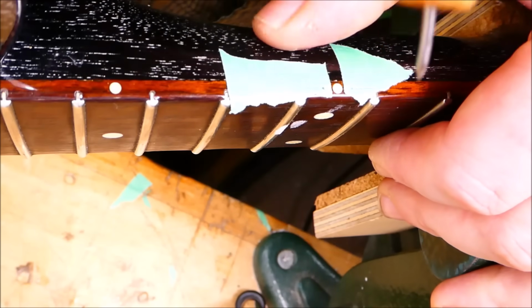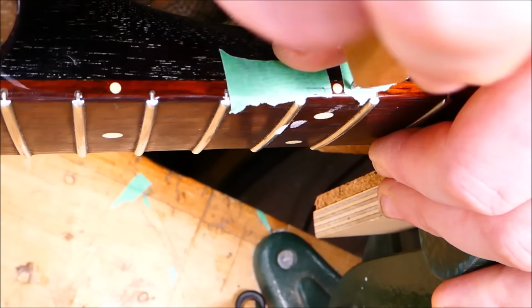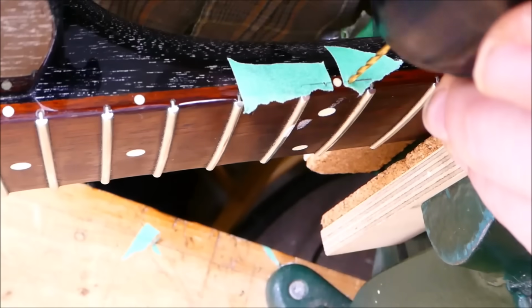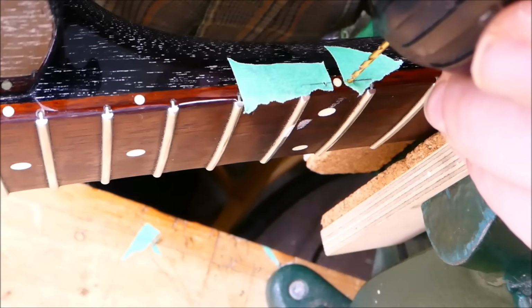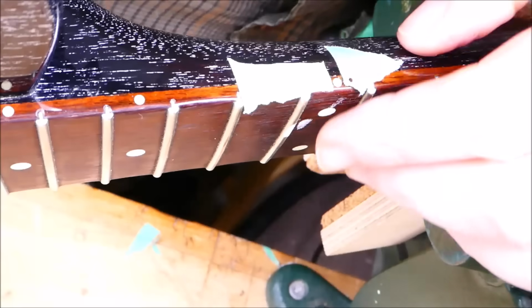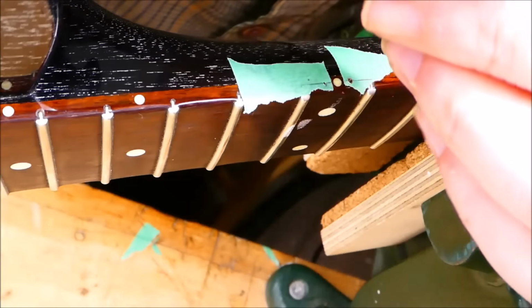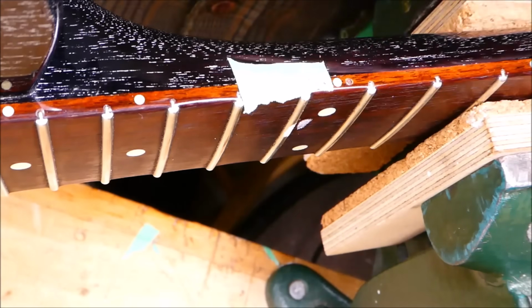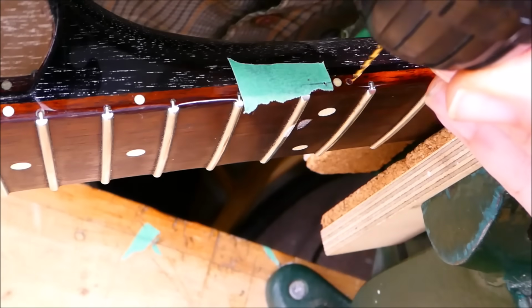Turning to the 12th fret marker, I'm going to use smaller diameter dot material because with 3 of them it might look more visually balanced and slightly more elegant. This is one of those fragile finishes I was talking about in a recent video. It's just holding on there and it's really eager to delaminate. I did have to rely on the super glue again to kind of stick the bubbles back down.